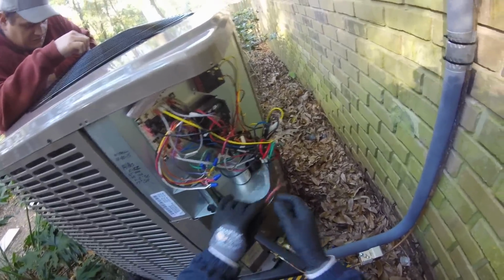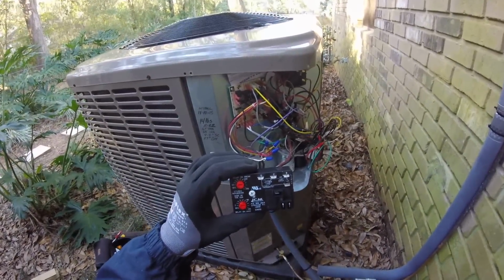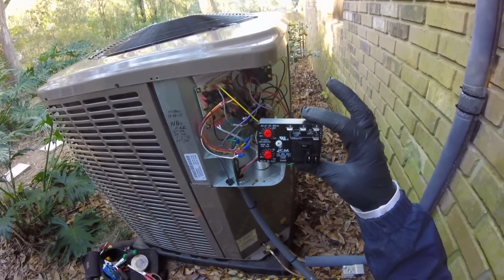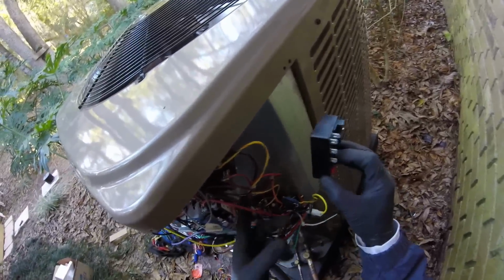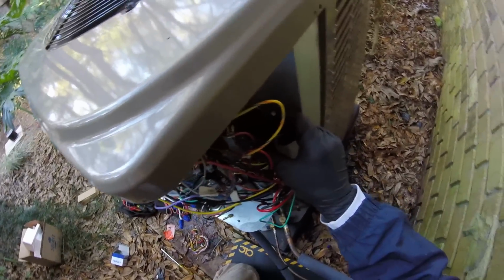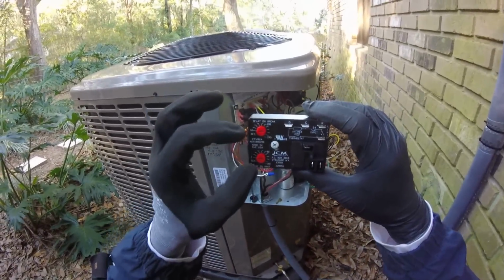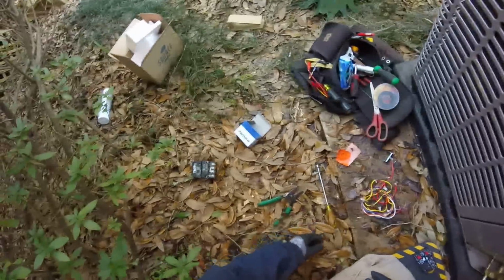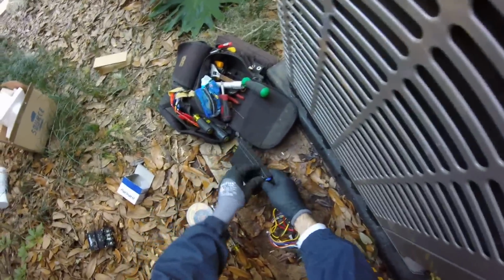Yeah, been pretty busy. I'm doing okay. So I gotta thank Mr. Zach Talon 875 for showing us this little doohickey here. It's going to come in handy. This is what's going to now control our fan motor. We're gonna tuck her in here, I think. She's going to delay off 12 seconds and delay on just 1 second. That's all I wanted to do, delay on making that loud noise. So let's get her mounted.